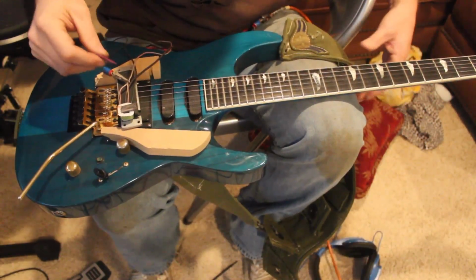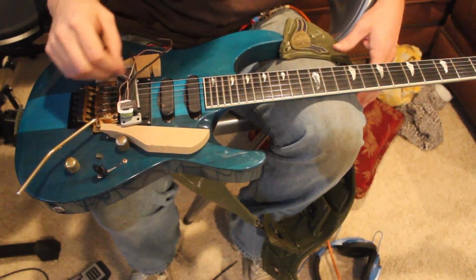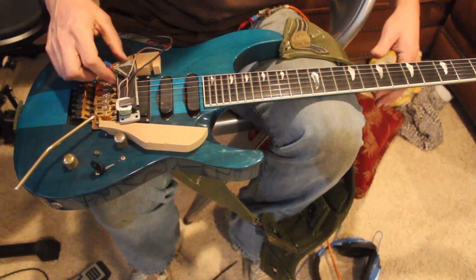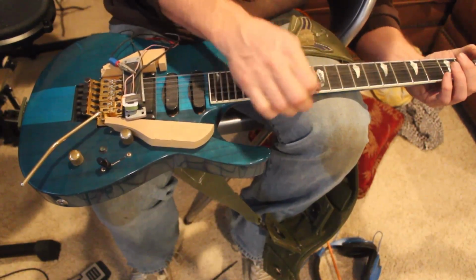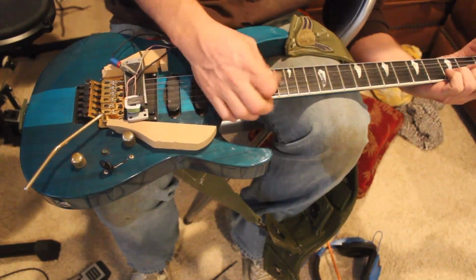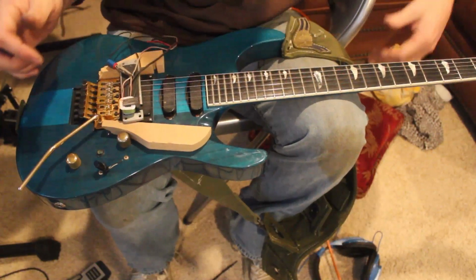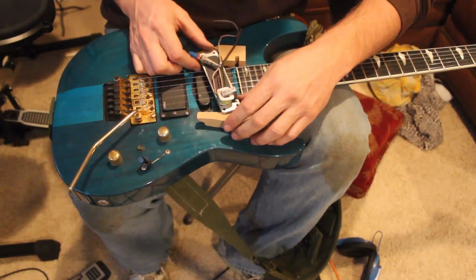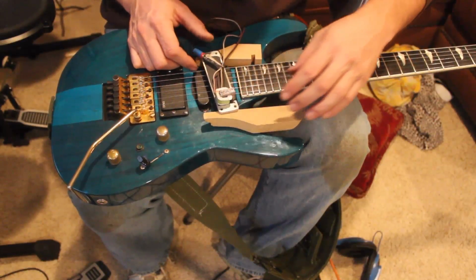Now we're set up, and unfortunately this is only half strength, so this totally sucks. For some reason the first half of the coil, when I hook it up, it does nothing, so there's either a short in there or something. So this is the last half of the coil. Even for half a coil, it sounds pretty badass. We can move it into the old neck position there, see if it sounds better, a little cleaner. The magnets are fighting it from the other coils.